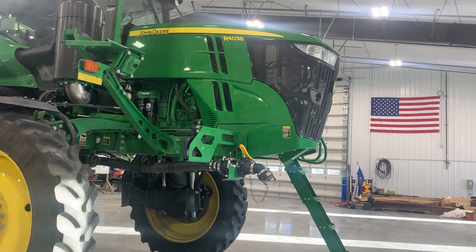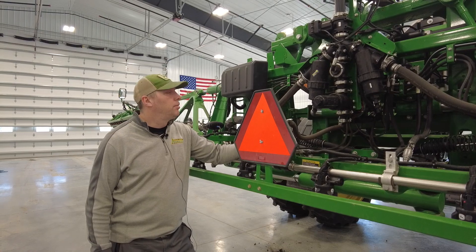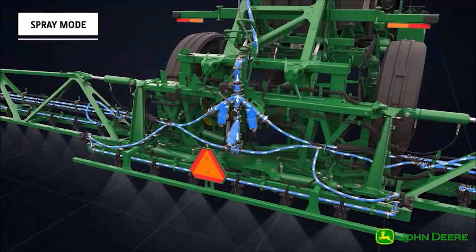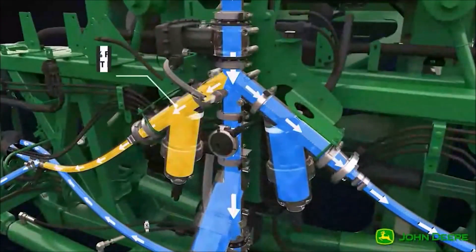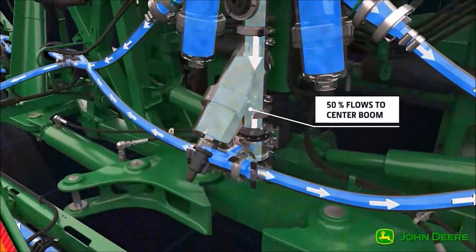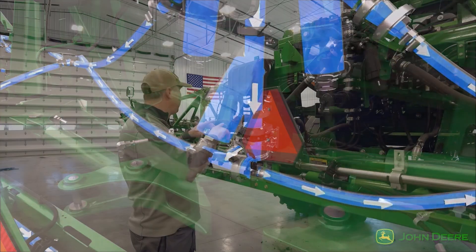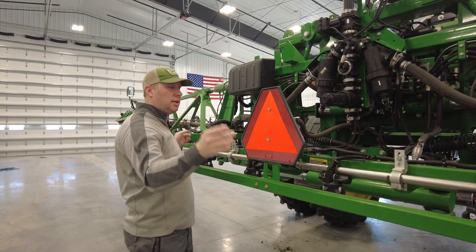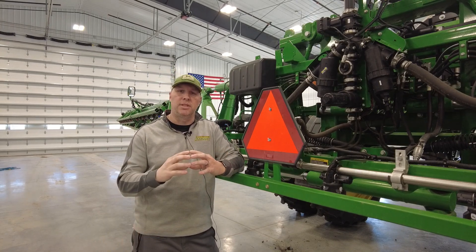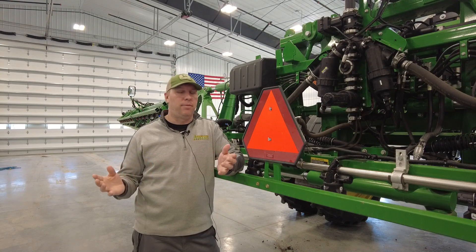Two new options for our performance upgrade kits this year are pressure recirculation and product reclaim. Pressure recirculation will run in two modes: spray mode and recirc mode. When we run it in spray mode, there'll be a three-way ball valve that will send product 25% to that side of the boom, 25% to that side, and the remaining 50% will go through a strainer and be pushed out through the middle booms to keep the product flowing constantly from the ends in. The reason for this is to keep solution with chemical in constant flow, to keep it from building up inside the lines, which can cause chemical damage as we're switching products.